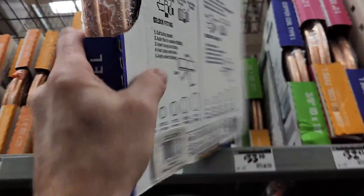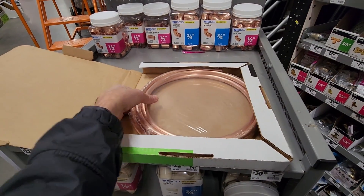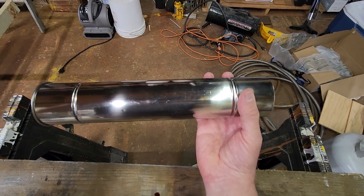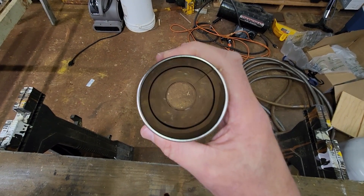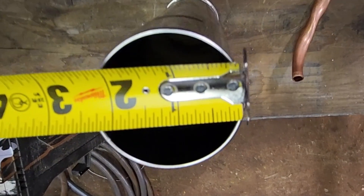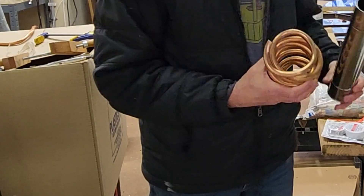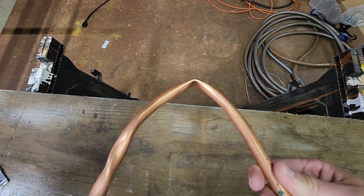My project started at Home Depot. This was supposed to be a prototype, but when I saw the price of copper tubing this quickly became a working model. I have a piece of stove pipe and the plan is to tightly wrap the copper tubing around it. However, since the stove pipe is less than two and a half inches in diameter, wrapping it tightly presents a challenge. You can see there's a lot of space between the tubing and the stove pipe, which means lost heat, but if we wrap it any tighter the copper tubing will kink.